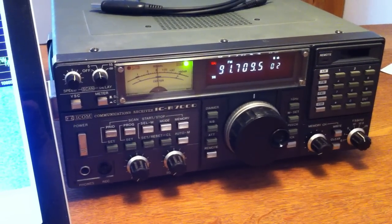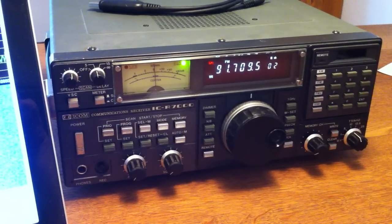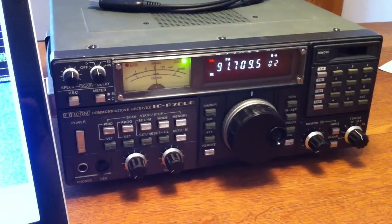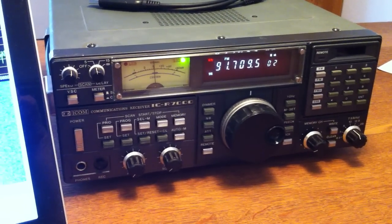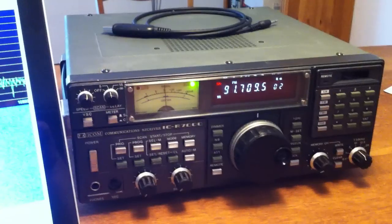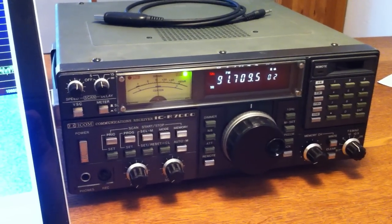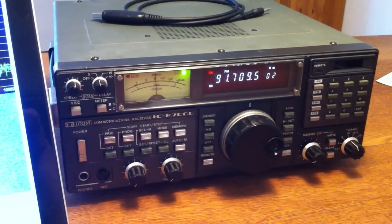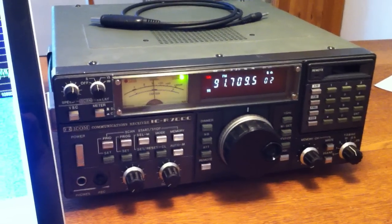That's also something to be aware of: if you're setting up a telescope listening at 1.42 GHz, and you have a jammer or something else coming in at 420 MHz, you're probably going to hear it. So as a piece of advice, you should definitely add some kind of bandpass filter in your antenna setup after the LNA — the first amplifier right after the antenna.